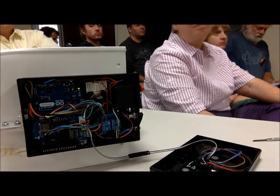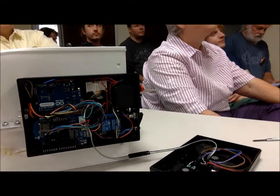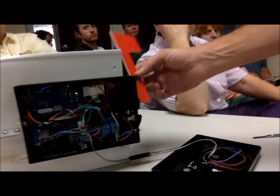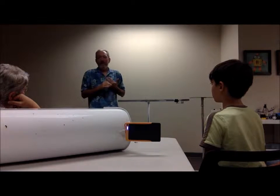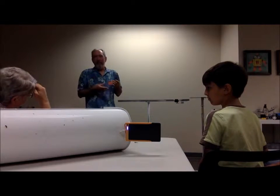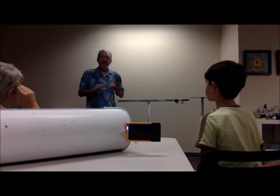And I spent a ton of time getting the power down to what could be powered by this solar battery. And what it took was, I don't remember the numbers anymore. I did this presentation earlier, but when it's powering the servo and the Wi-Fi and talking, it uses something like, I want to say 350 milliamps, which is a lot. And when it was just idling, it was using like 50, which is way too much because the batteries can only supply much less. And I needed to get the power down to like 10, right? Which is just a big difference.